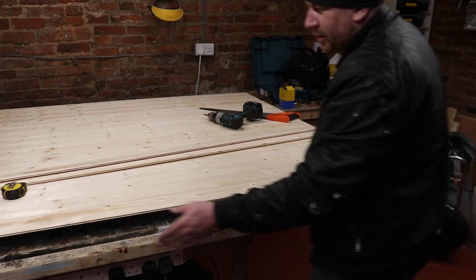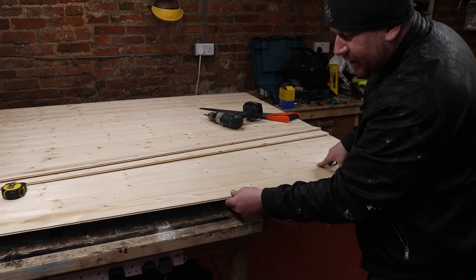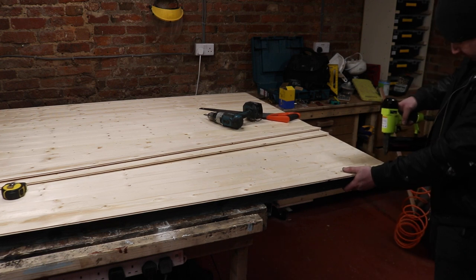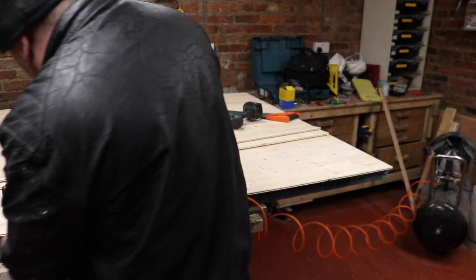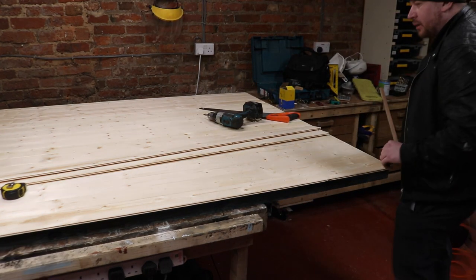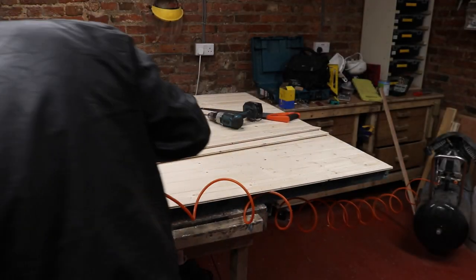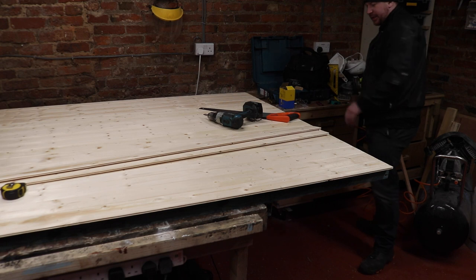One benefit is just how these panels interlock. There's a 20mm overhang on the bottom which is perfect - it means I can slide that up to the edge of the ply on the base and the rainwater isn't going to attack the end grain of the plywood. I just ran out of staples so I popped a couple more in that end. Right, now I can continue with the build proper - not a massive upset.